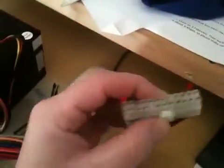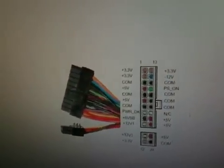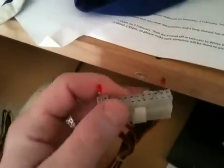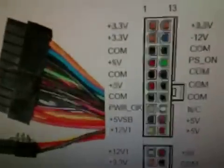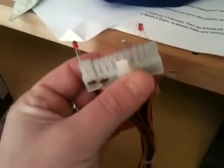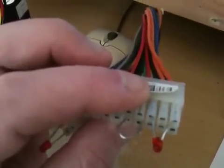I've just got the ATX motherboard lead — it's in two parts actually. If you look at the computer screen here, you can see all the outputs and what voltage they are. What I've done is these things need to have the green PS-ON earthed to a common wire for it to turn on, so I've used a paper clip in there for that, and a couple of LEDs to show that it's working. The orange wire is the 3.3 volt output, and a black wire for the negative — same at this end as well.